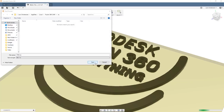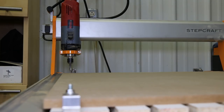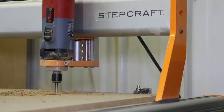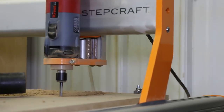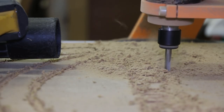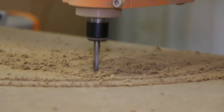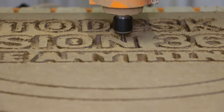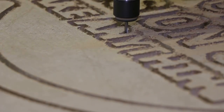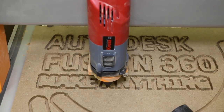I posted using the UCCNC post, which you can download from the Autodesk post library — just Google it. The Stepcraft actually comes with a tool changer I need to get mounted. This shot is the actual feed rate — not sped up — 700 millimeters per minute, just to give you an idea of real cutting speed. I also added a slow-motion clip for excitement. You can see the 3mm cutter doing the rest machining, cleaning up the letters and getting tight into the corners.